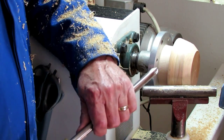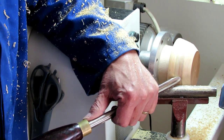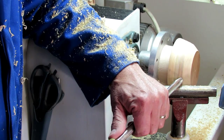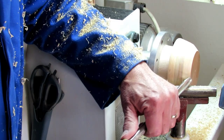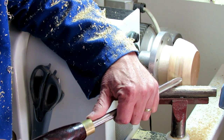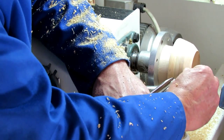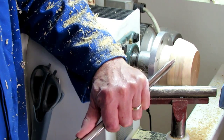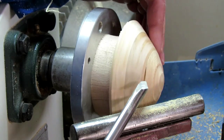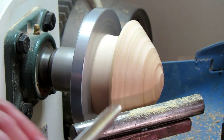With the tailstock removed, you must ensure that if you want a perfect cup, it can come in from the side of the headstock. My recommendation is just above the first block. Why? Because if you're going to cut in here and take off a lot of wood, it will catch on the first block where it's glued and it might just rip off — so be careful of that. I've got a bit of tear out on the first block on two sides. I'm coming in from the headstock side with fine cuts.